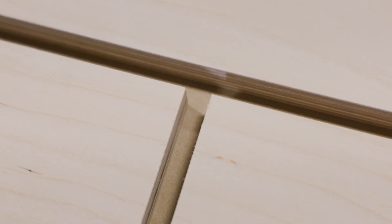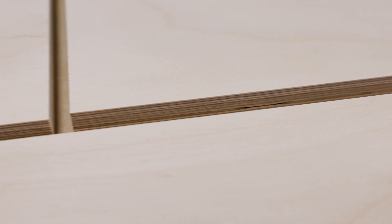One thing I wanted to point out when we were cutting this Baltic birch — a lot of times using a compression bit, you'll see a little bit of dust still packed in. But if you take a look again, you'll notice how well that dust boot worked and there was nothing left. Dust free, a lot less to clean up, worked out really well.